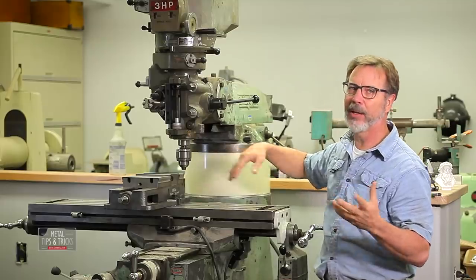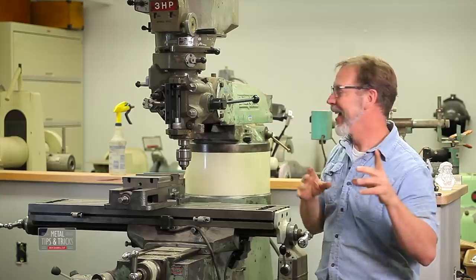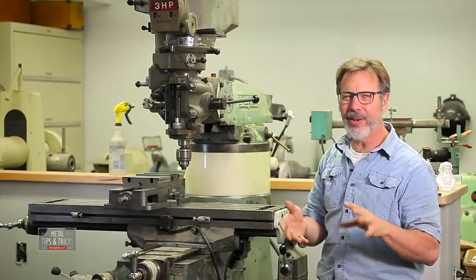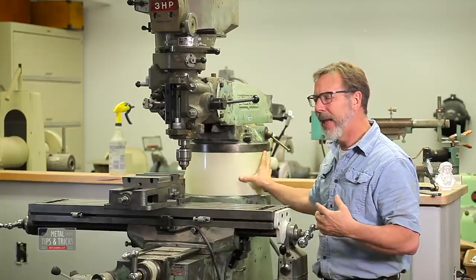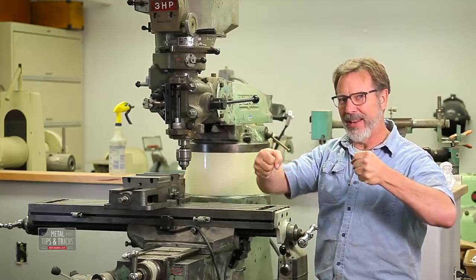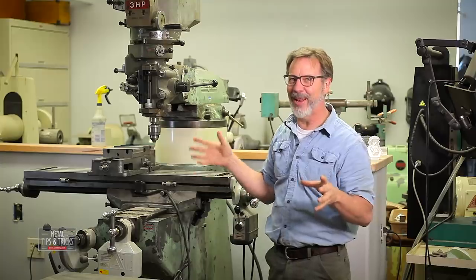I really enjoy having this riser block. This is my third milling machine to put it on and I will always have it on my Bridgeport. I did have it on an ENCO and everything matched up, but I can't guarantee a Bridgeport riser block will fit on other machines. Some people have talked about building one — I think you could, but they're only about $300 to $400 used. It would be a lot of work to build one, plus I like that it's made of cast iron rather than steel. Cast has rigidity and comes back to its natural state very quickly, where steel can bend and fold and get manipulated over time. Cast iron just works so much better.